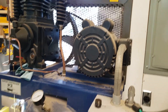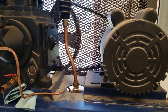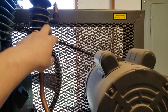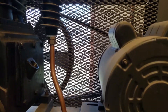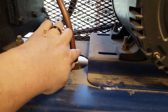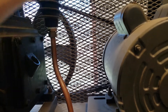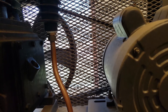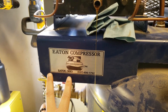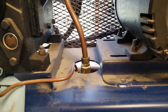I'm going to add an air cooler, which goes in between the pump. It'll come out of here, go around the back of the guard to the cooler, come back in at the check valve. I'm going to come out of the pump, the other side of the guard, into the cooler, out of the cooler into a water trap that I'm going to hang right here, and then out of the water trap into the tank at the check valve. That's the plan.